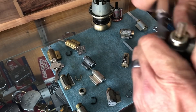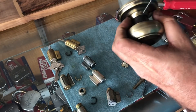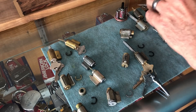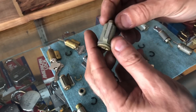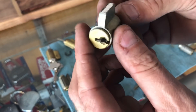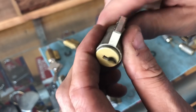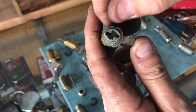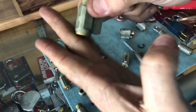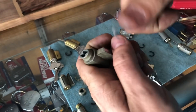One little caveat: if you're a locksmith and you have a lock picked — like on the Schlage F series where you have to pick the lock to get it off — you would have to shim it to take it apart since you're in a re-key phase. What I do on this style cylinder is turn it all the way to the positive stop, then when pushing it off I hold the plug on my finger to keep it still, and just push and pull.